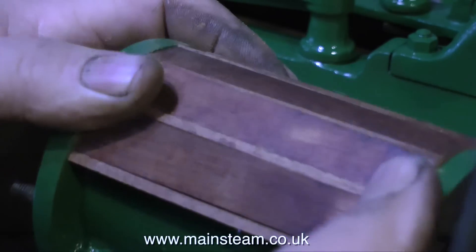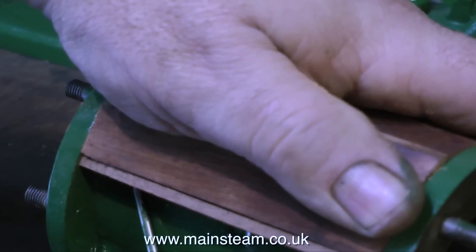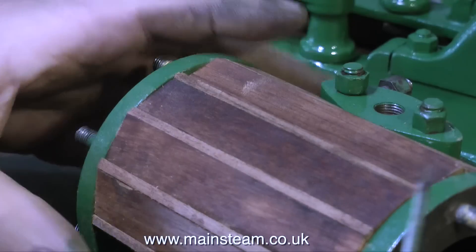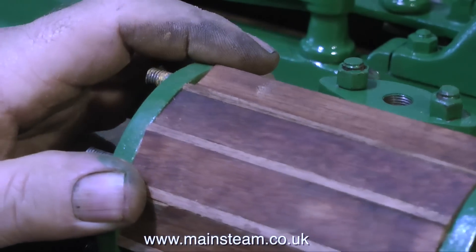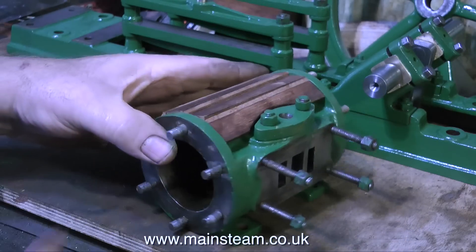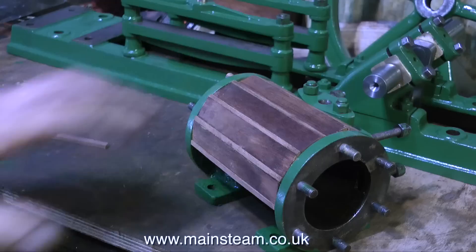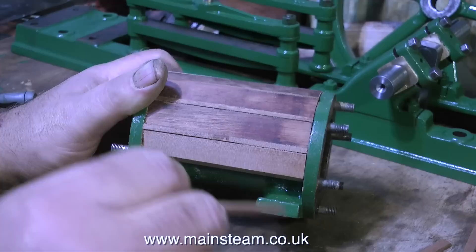Even with the small pieces I'm still one piece of mahogany short, so I'll cut another piece on my small bandsaw — I won't bother showing you that, it's very simple. I'm able to use a couple of small pieces of brass boiler banding to hold the mahogany lats in place, but I'm not sure about that until later on. The final piece of mahogany I need to cut on the bandsaw needs to be shaped, otherwise it will get in the way of the bolts that hold down the cylinder. By shaping the piece of mahogany, there's no fear of it fouling the bolts that hold the cylinder down to the bed plate.